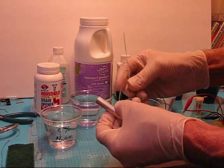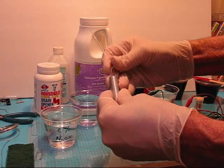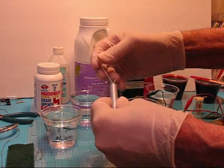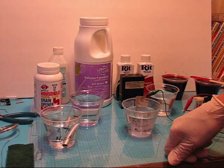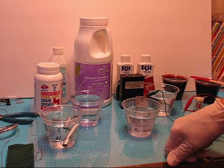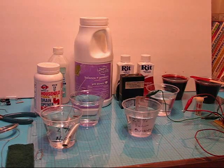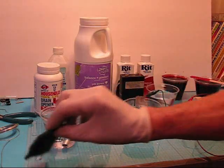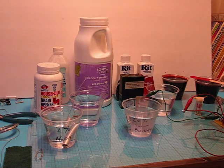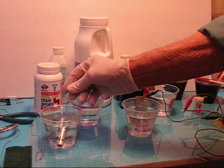I just use a piece of aluminum wire and force it in so it makes contact. Move it around a little bit and put it in — it only takes a couple of minutes and you'll get a reasonably clean surface. However, it will be a matte finish. If you want a higher-grade finish, you'll need to use something like Scotch-Brite and a detergent and clean it up as best you can. For a really high grade, you need to polish it with a high-speed Dremel or a buffing wheel that jewelers would use.